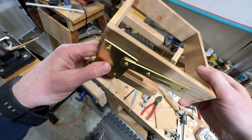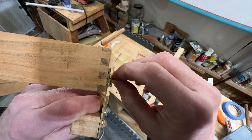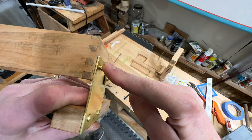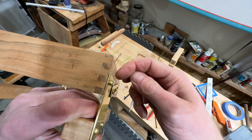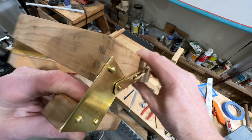What I just made are the bushings, which allow the thread to not bind. So the screw is tight, which holds the bushing in place, and then the arm is allowed to rotate around it.